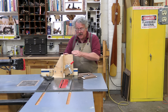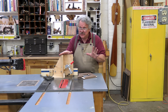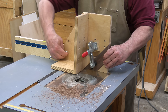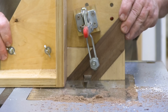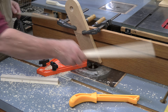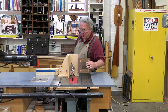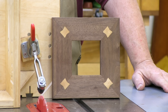However, you can also use this jig to cut them from face to face, and you do not have to stick with the table saw. Instead of the saw, I'm using the tenoning jig on a router table. By cutting through the faces of the mitered boards with a dovetail bit, I'll create some butterfly joints. And you can use this same setup — minus the jig — to make the butterfly splines. The results, as you can see, are spectacular. It's a simple jig, but it's remarkably versatile.